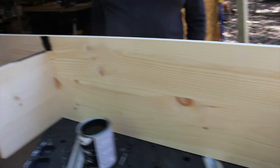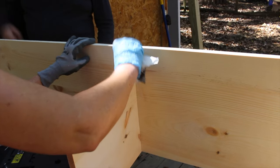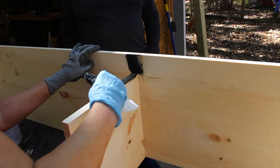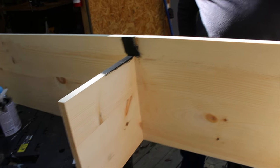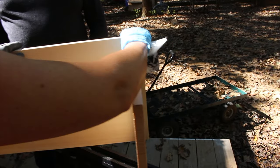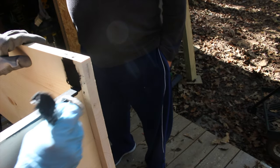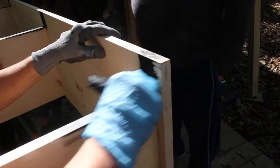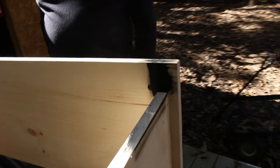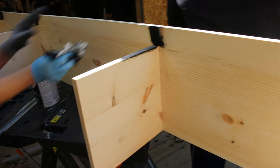So basically staining these four sections. Yes. Well, and we need to stain all the top. This top section. Oh, okay. And then attach all the final trim pieces, and then stain the rest of it. This is just to improve the finish. Is that an issue that we have also when we do Shou Sugi Ban or not? It is. That's why I tend to prefer doing the burning before we assemble a project, because you see seams and you'll see sections that don't get burned correctly. So, okay, we're going to do that, then we're going to do the assembly.